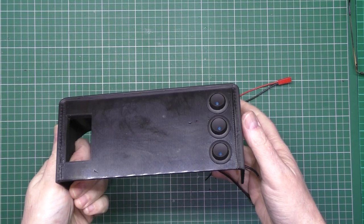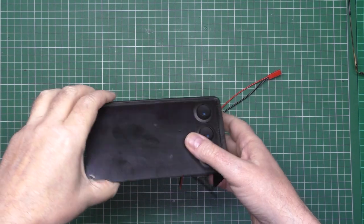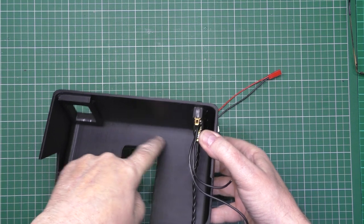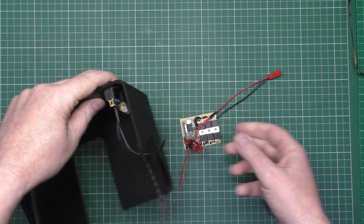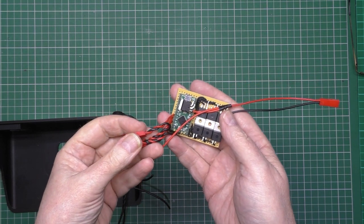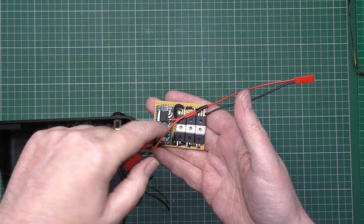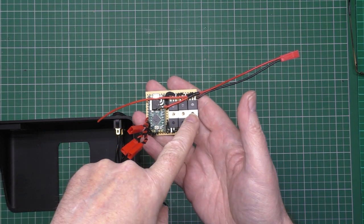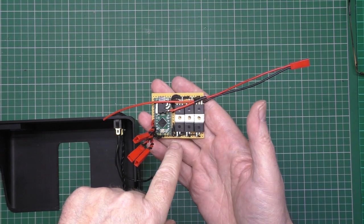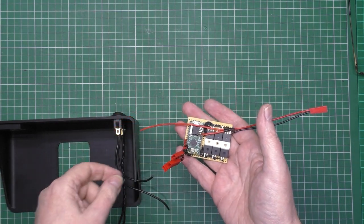This is my new switch panel — power switch, function switches. The BMS sits up here so I can't do a lot anyway. These switches go there. This is the switchboard, I've got three connectors here which go to the switches. The Teensy detects whether it's short or open and then it'll fire any one of these MOSFETs — these are just N-channel MOSFETs, link in the description. The outputs from those go to the LEDs.